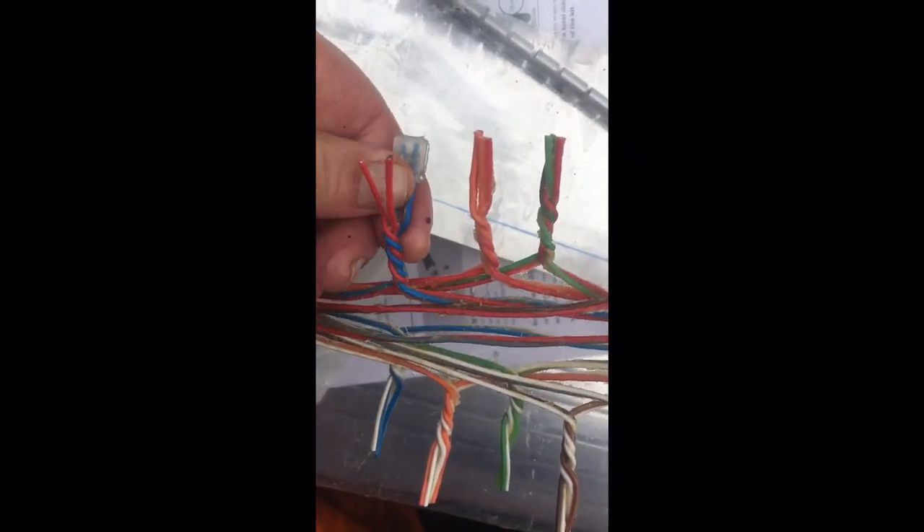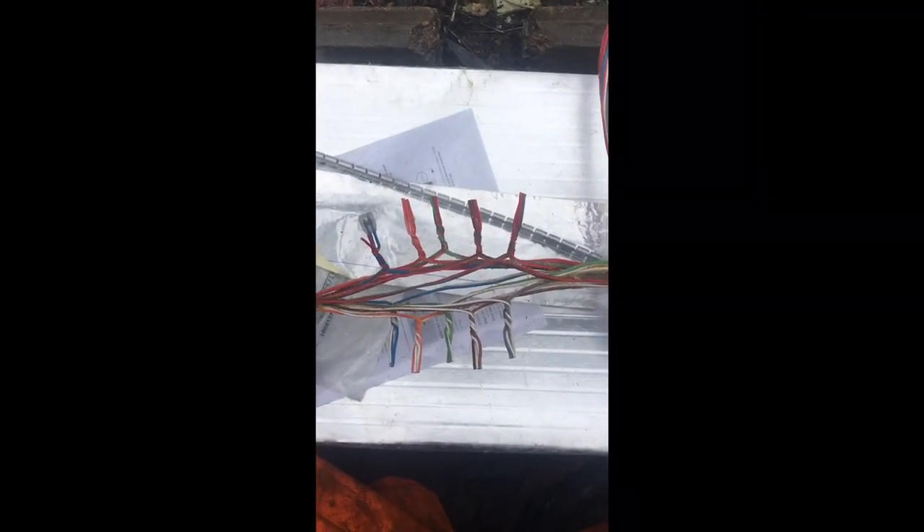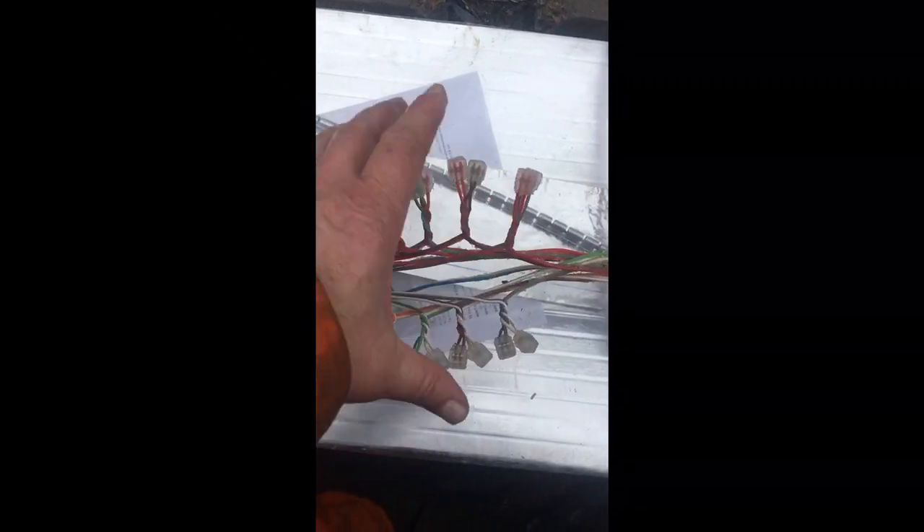Make sure it's a good crimp. I always do a full test — the blue's right at the top, pull — it's not coming off, that's fine. I'll get that all ready and I'll show you what the 50 pairs look like. So there you have it, all the crimps have been pushed on and crimped down. Now we've got to fold those back like so, put them up on the right side and then fold them under like this to keep it nice and tight. There's your blue whipping to blue whipping, and that's a straight through joint.